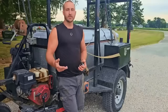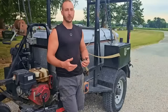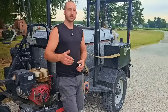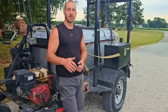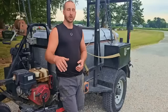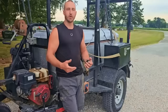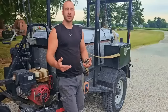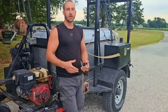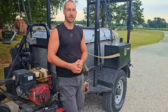As far back as the 1700s, people have been making burial vaults, whether that be out of brick or stone, to protect the casket from grave robbers and animals and things of that sort. So now the grave doesn't have to be 6 feet deep because those were the reasonings for that grave depth. For us, we want to have around 18 to 24 inches of soil above the vault, which means that the grass will have no issue with growing above the vault. You want to have at least a foot of soil to make sure the grass can grow and it won't die when it gets hot outside.